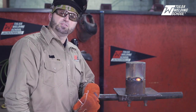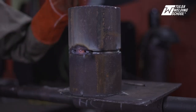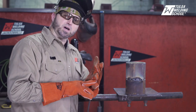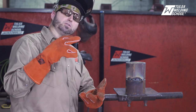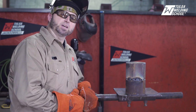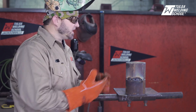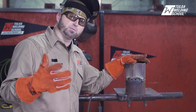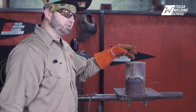As you can see, we have done nothing but made a mess with this piece of pipe. Look at all the problems we've had in here. I've shown you multiple examples of errors: first we talked about long arcing, then your angles being off, then going too slow and going too fast. All these things ultimately lead to a failure of your weld. We need to try to avoid these. I'm going to spin the pipe around and show you a nice good way of fixing all these — run them nice and smooth, keep a nice smooth consistent rod angle, travel speed, and arc length.